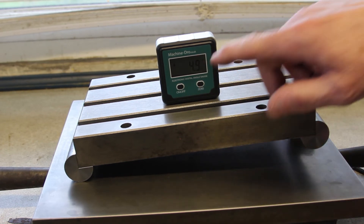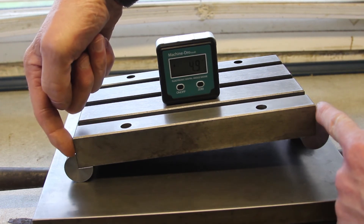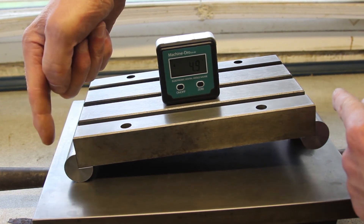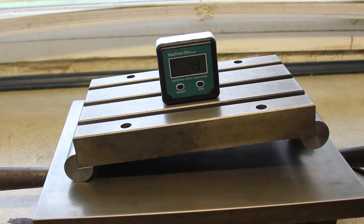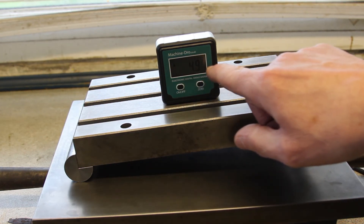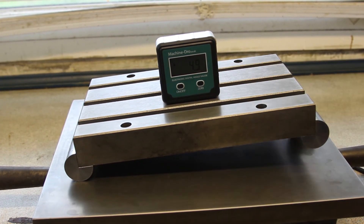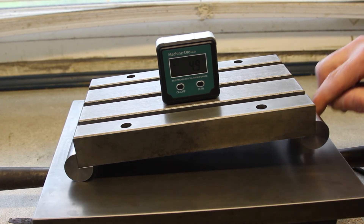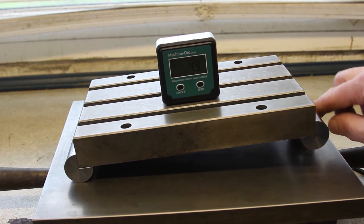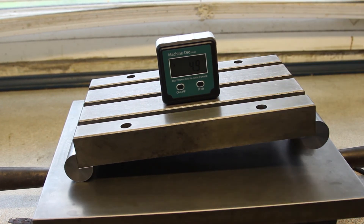I think 4.9 is good enough. I wouldn't trust the angle gauge as much as I would trust the plate, because it's a calculated known entity. The distance between the two pivot points I can reasonably accurately measure, so I could improve my accuracy by knowing that in more detail. These digital gauges are always going to round up or round down. This should have been 21.3mm - adding 0.03mm there would probably make that read five exactly. So yeah, I think we're there really.